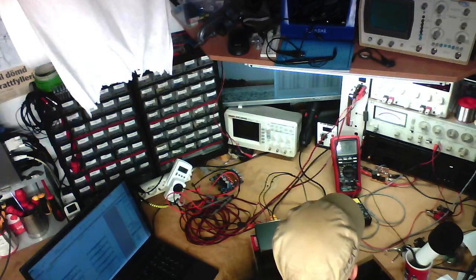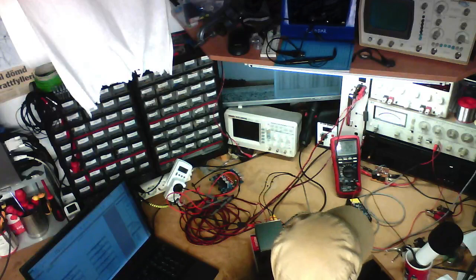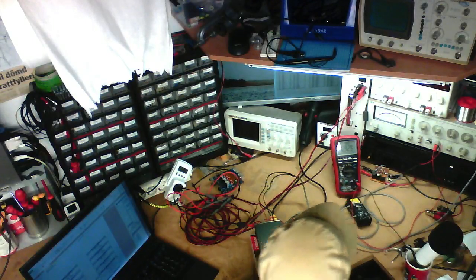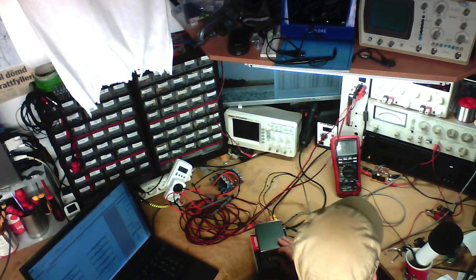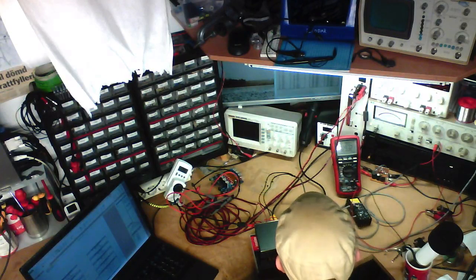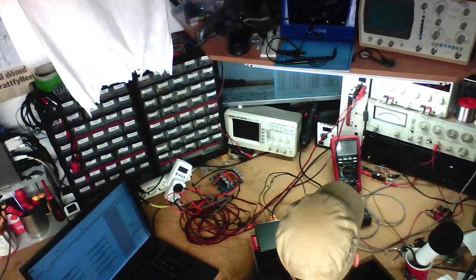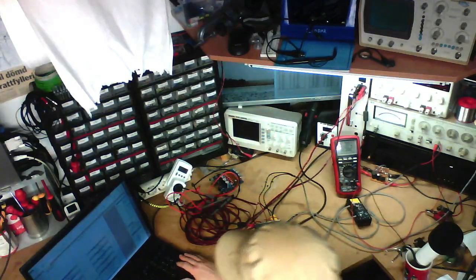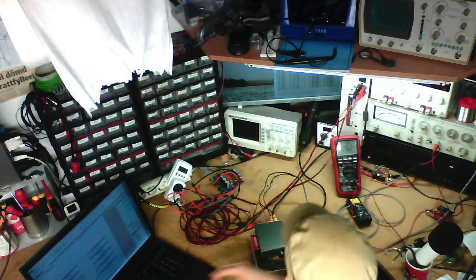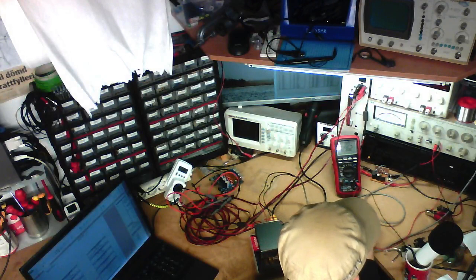So when rating this thing, should I turn it down until it's not clipping anymore, or should I just take a data point here? The issues you have to resolve as an internet reviewer. I'll just take a data point here. It's interesting, we've got 0.4%. Come to think of it, that actually is within spec, since it's specified for 1% at its rated power. Go figure.